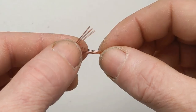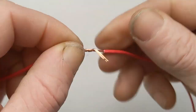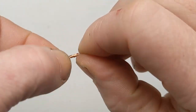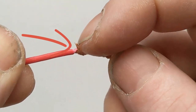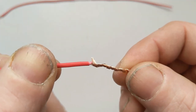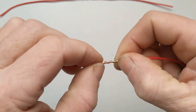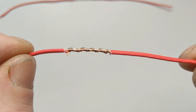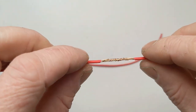Our second type of joint is going to be a Lineman's joint, as they call it. This is where you're actually going to twist the wire around the outside like so — which isn't a bad option either. I don't prefer using this method only because a lot of times you're stuck with wire strands sticking out, and if you're using a thicker wire that can really be an issue when you put the shrink wrap on. However, if you're in a really tight spot where you can't get the wiring out very well and a mesh joint is too difficult to hold together, this is a good alternative.